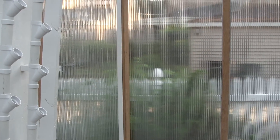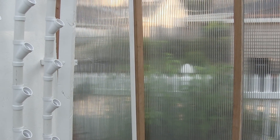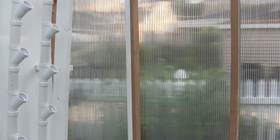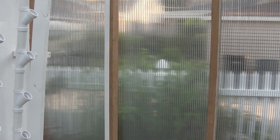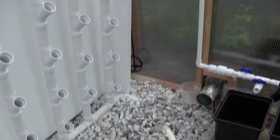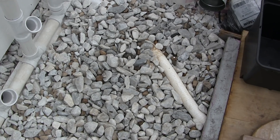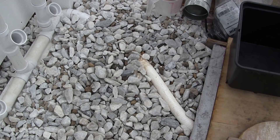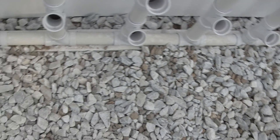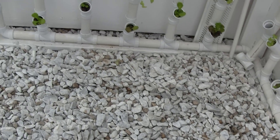The idea for the winter is to build a solar collector which is going to sit facing south with a thermostat on the inside. I'm planning on using aluminum fins and running a pex-al-pex line out there with aluminum lining for better conduction. The solar collector will heat up, and then I'll have a pump underneath the floor — a 55-gallon polyethylene drum that's going to hold the antifreeze — pump out to the solar collector when the temperature heats up, heat the water back into the 55-gallon drum, which will then at night send the fluid through the floor and heat up the greenhouse.